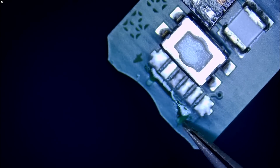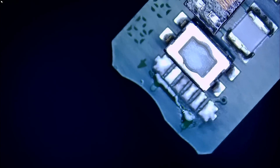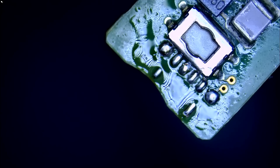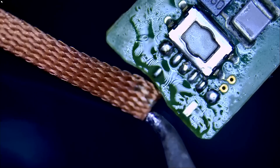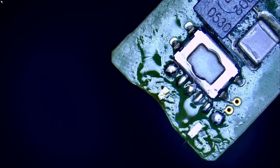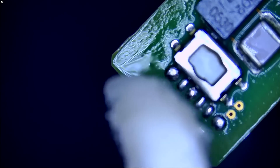We're going to remove solder from those two unused front pads on the original. We'll apply solder mask to cover them since they're not being used, and we'll use the six pads we see here — one, two, three, four, five, six. I'm placing the original fob on the edge of the board holder so we can heat from the bottom. Since the front pads are not being used, I'm removing the solder because it may interfere with the height of the component. I wick off the solder, and if you notice, I twirl the swab in a clockwise motion to get stuff away from the switch.